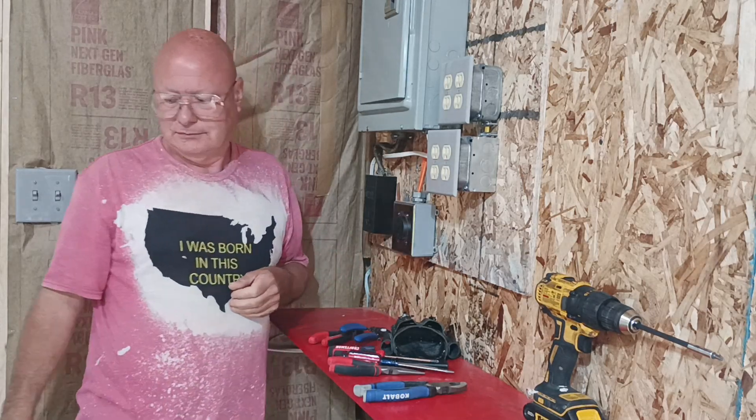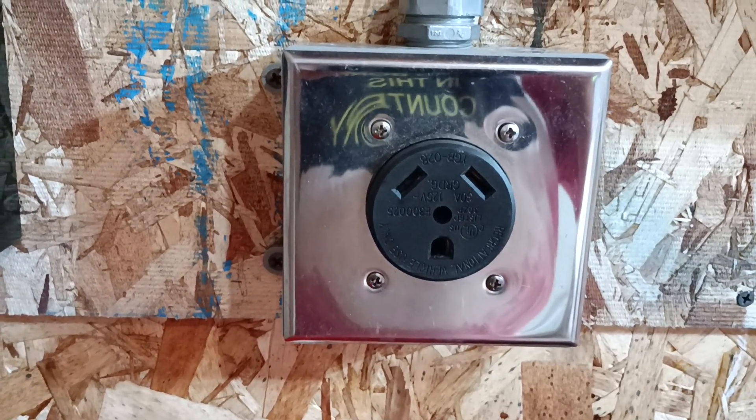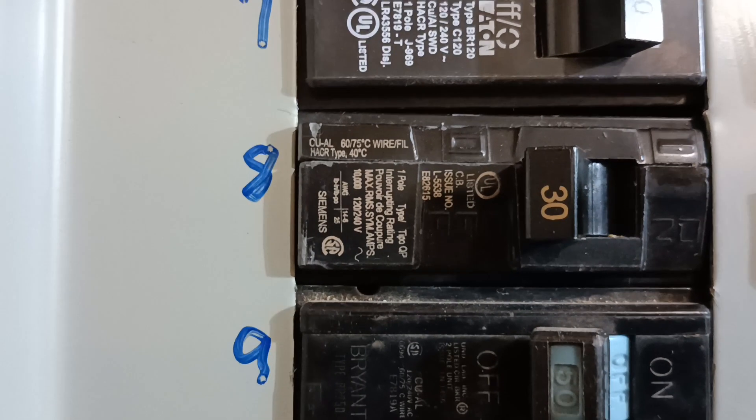So there it is, all done. That is an indoor use 30-amp RV outlet, on that 30-amp single pole breaker right there. That is how to wire a 30-amp 120-volt RV outlet. The black wire was live, the white is neutral, and the bare wire is the ground. Here in the country I was born in, we use 12 AWG on 20 amps, 14 AWG on 15 amps, and 10 AWG on 30 amps. Black is live, white is neutral, green is ground. Red and blue are also live colors. However, you may find white live in a switch loop or a 240-volt circuit where the appliance does not require a neutral. Peace — thanks for watching.